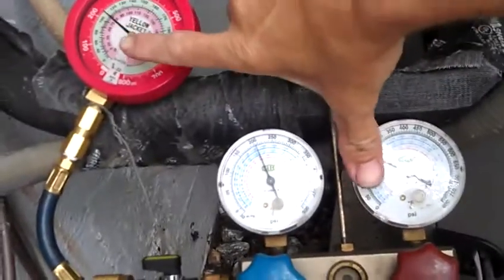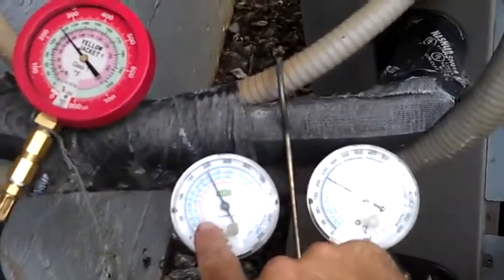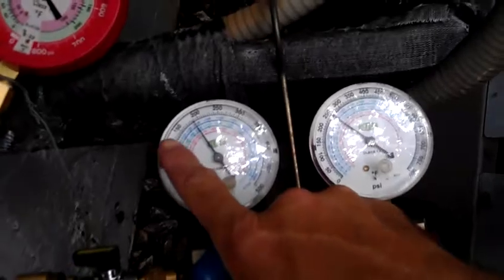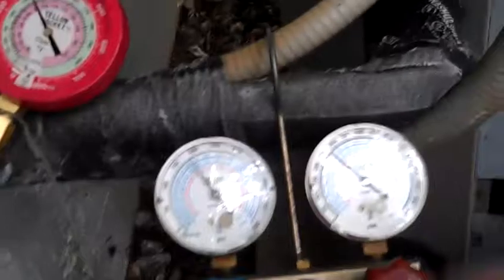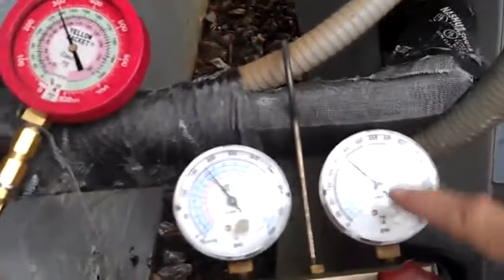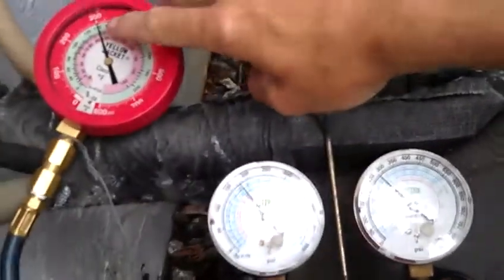So I'll take the reversing valve off. Going back to our gauges, these two should now be the same, and this is now my suction. We're going to watch this. If this reads back up in the hundreds — about 125 to 150 — then I know the refrigerant charge is right and it's all in the metering device. As I'm watching, this one's reading about 275 to 300, this one's right at 300.